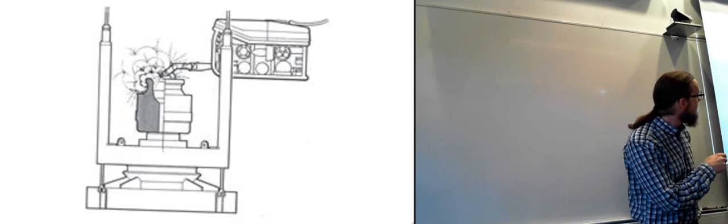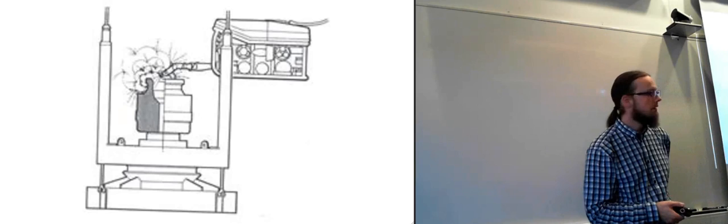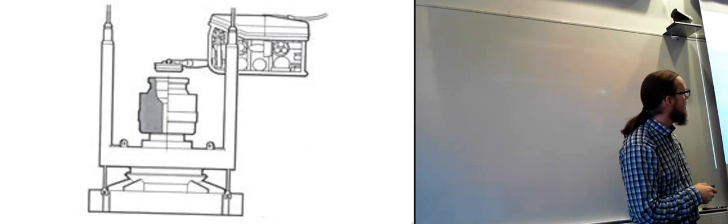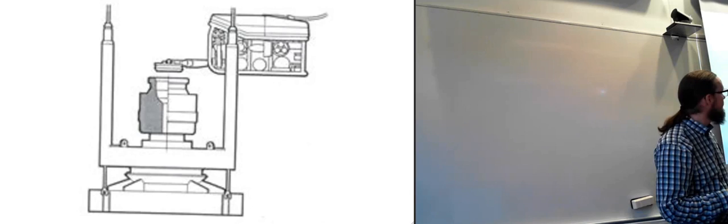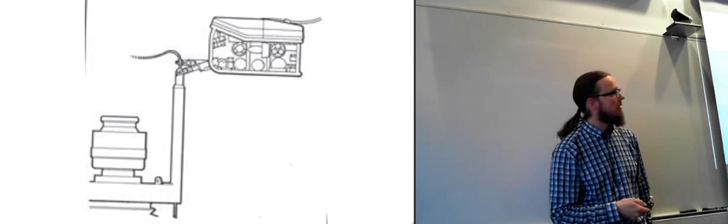In this case, they're going to connect a Christmas tree on top, and they have to make sure all dirt has been removed so nothing interferes with the sealing of the Christmas tree to the wellhead. The ROV is placing a sealing ring inside the wellhead before the Christmas tree is lowered down and latched. First it cleans the area, then places the sealing ring, then connects the guide wires to the guide posts so they can use a running tool to put the Christmas tree down.